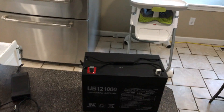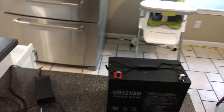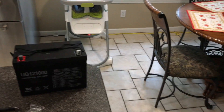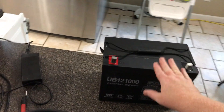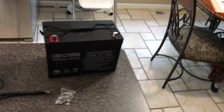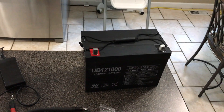Why did I choose this battery? If I got 6-volt batteries, I have a 12-volt system, so I would have had to buy two 6-volt batteries, which exceeds the cost of one of these. If you look up the price of a 6-volt AGM battery, it's more than this, and I would have needed two. So financially this is a better deal. Plus, AGMs last longer than flooded lead-acid. I can use it year-round and don't have to worry about it freezing. I still want to temperature-control my shed a little, but not like with lead-acid. And it's maintenance-free.